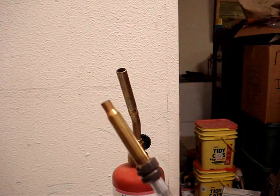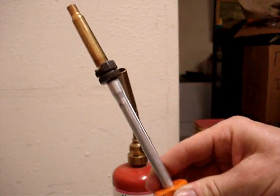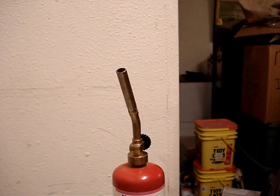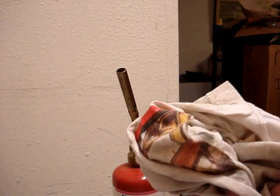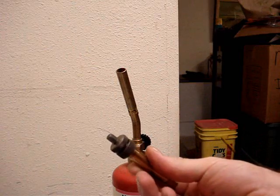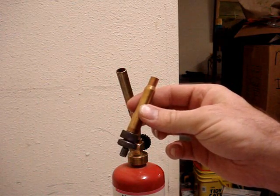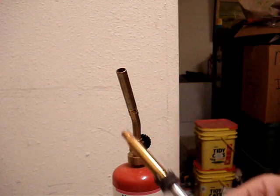What I'm going to be using is an extended screwdriver so I can anneal the brass without getting my hand in the way of the flame. You can wear gloves — I'm not wearing gloves — but I'm going to have a little rag here so I can unscrew it. All this is right here is the Lee shell holder for their trimmer. The Lee makes some stuff that has multi-uses.